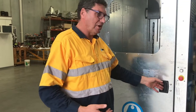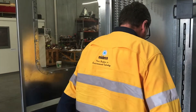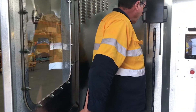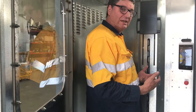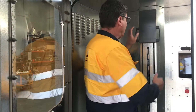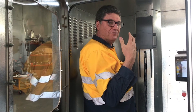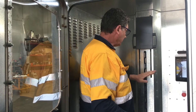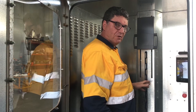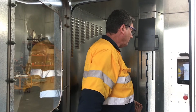Basically what we're doing here is we're looking after the guys for silicosis and various different lung diseases or things that damage the lungs. What we have here is a chamber that guys get in to actually clean down. First thing they will do when they get in is adjust the height — we don't want to be blasting people on the face. We need to know we're blasting at less than 2 bar, so we are within the limits of compressed air usage on the human body.